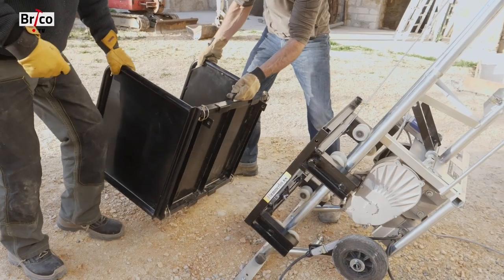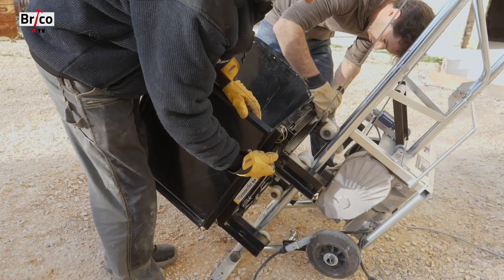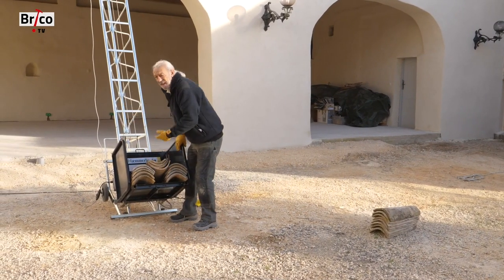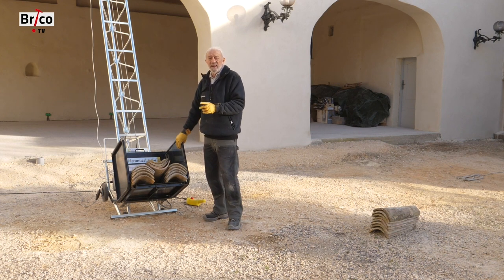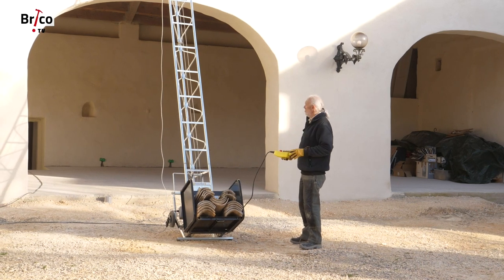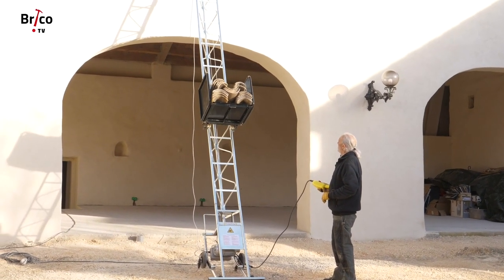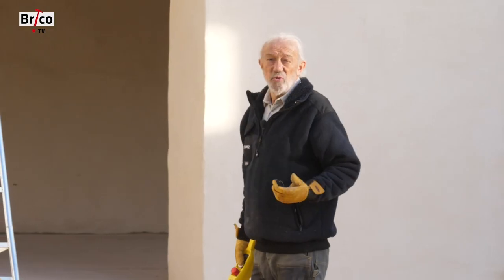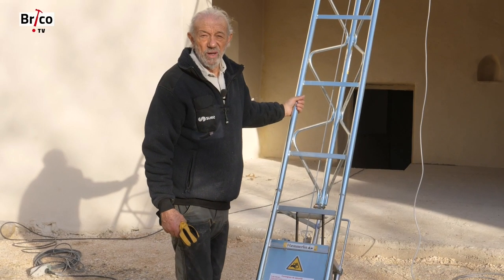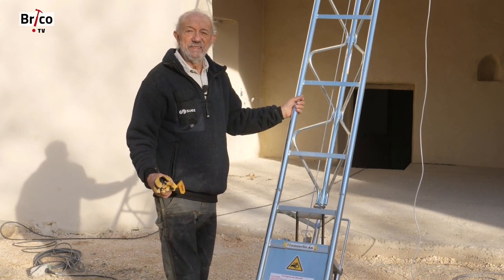Now all that's left to do is hook the cargo bed onto the trolley, and it too is secured by pins. The material hoist can lift up to 150 kilos and is equipped with a stroke limiting system — that is, an automatic stop at both top and bottom. Mounting materials with equipment like this is almost like playing a video game. The automatic brake means the trolley can't go back down no matter what, even if there's a power cut. The basic equipment can also be fitted with options and additional accessories, including ladders for climbing up to 20 meters, as well as shoring and anchoring systems.